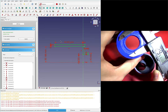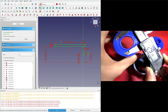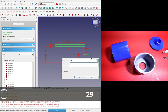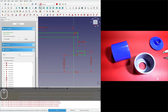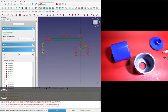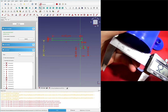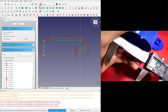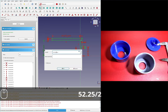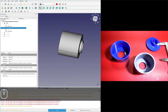For this internal dimension, we're looking for 29.5 — it appears to be about 29.8. We'll change it to 29.8 divided by 2. That did not change it much, so it was probably just the thread that was off there. For the external thread, I'll measure it once more — we get 52.25 — so we'll set that to 52.25 divided by 2, which made it a little bigger, as one would expect.